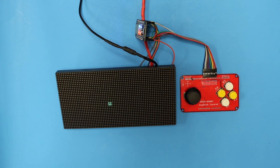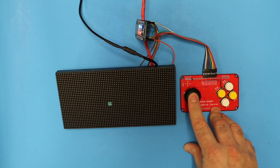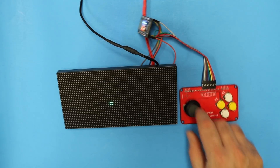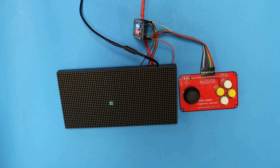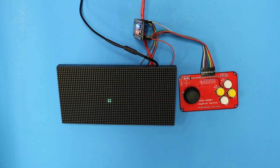Definitely load up that sample program — it uses a pretty simple library for writing out to the LED array. Look through the code and try to get a feeling for how the controller is read. The X and Y axes are actually little potentiometers, so they're analog values done with analogRead. The four buttons and the Z button on the joystick are just digital inputs. You can also see how the library is accessed to draw individual pixels, lines, or output text.